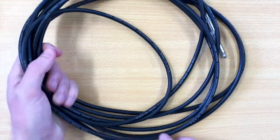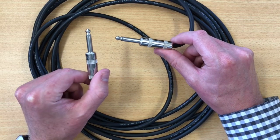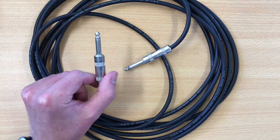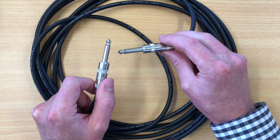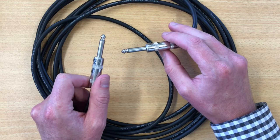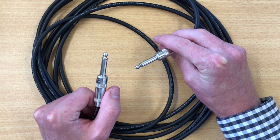Your simple TS cable is what you use on electric guitars or any electric instrument — an acoustic guitar with a pickup, or a keyboard — over a short distance. It can be plugged into an amplifier, a DI box, or into some pedals, and it will work really well over short distances. The reason these cables aren't made any longer is that beyond a certain distance they will pick up lots of noise and interference. We're talking about 15 meters. If you want to run over distances longer than that, we're going to need a different type of cable — we'll talk about that next time.